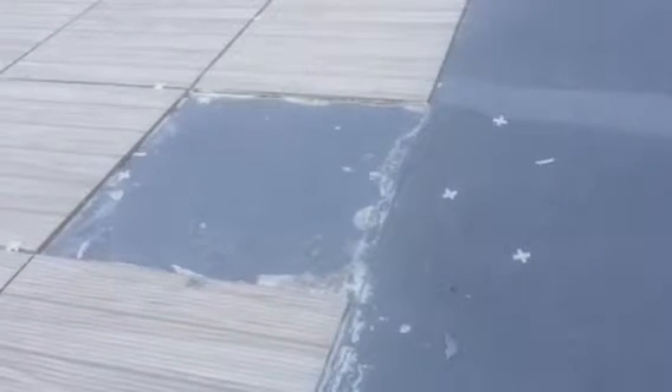This is the exact same stuff they use for showers, but on a hot day these tiles end up being about 150 degrees. When it rains, the water runs underneath them and then the heat makes the water steam, popping the tile off. We just started realizing this the other day. I didn't do the rest of it — we still have more we can return. I've never seen this not stick to membrane, and this is VersaBond. Should we just pour concrete up here or find another bonding agent? We can experiment with liquid nails and other things to make sure the tile sticks.